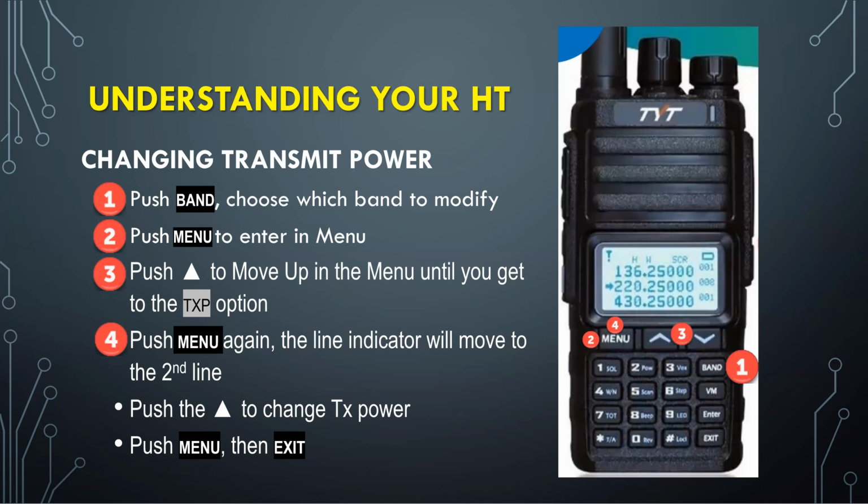So in other words, when you're transmitting on your HT, it's transmitting information on a particular frequency. That frequency has a certain amplitude, with different strengths when it comes into the radio. The squelch controls how powerful that RF signal has to be for you to listen to it. If I have a squelch value of 1, that means there's very, very little squelch, so I'm going to not only hear the transmission, but more than likely a bunch of other things that go beyond the noise level where the squelch is set.